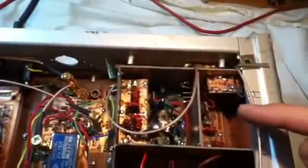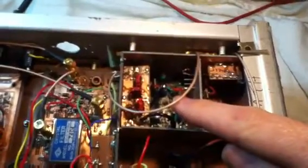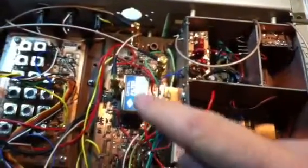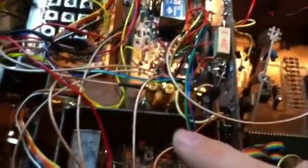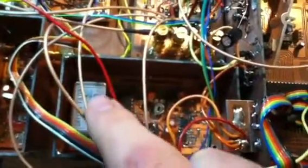In the back compartment — I'll just show you in here — is a 107MHz reference. Here is the DDS AD9958, coming out into the IF strip. There's a 10.693MHz crystal filter from a CB radio, then out of the IF strip into the product detector, into another 10.693MHz filter.